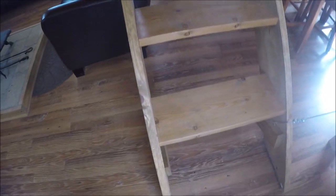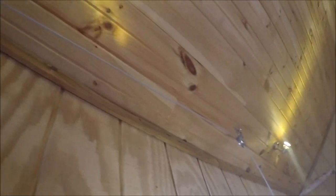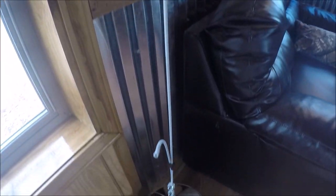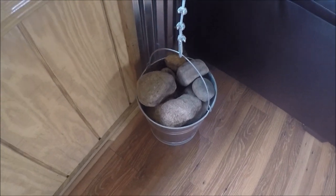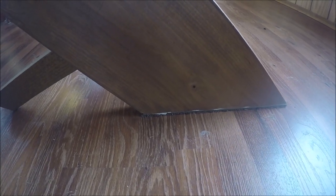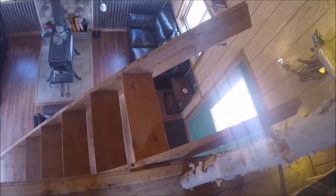You'll notice that there's a steel cable attached to the bottom of the staircase which supports the counterbalance. It runs upward to a pulley and across to a second pulley, which essentially moves the counterbalance weight out of the way. It then moves down vertically to the counterbalance, which in my case is a steel bucket filled with local river rocks. You can adjust the weight of the counterbalance by adjusting the size of the bucket or its contents. I glue carpet pads to the bottom of the stair to keep it from scratching the floor. Here's a view from up above.